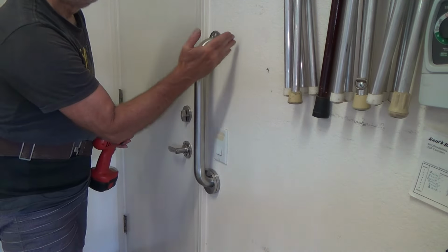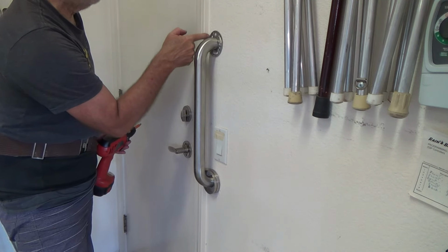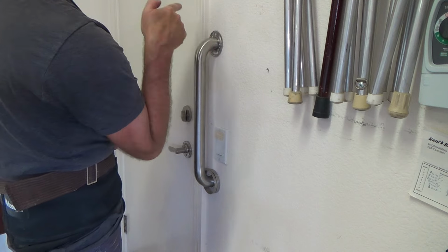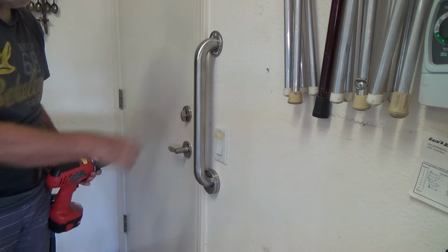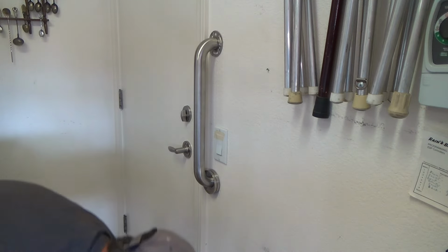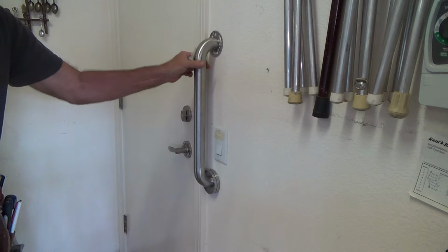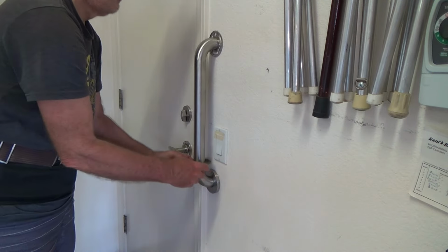Had I had this moved over, I could have moved this over a 1/2 inch and still caught the edge of the stud, not with the 2-inch, but with the 3-inch screw going through there and then hitting the edge of the stud on the side. You know what I mean? But you could hang off of that, and it's never ever going to get loose. And now I still have my stainless steel screws I can save for another project. I don't need those stainless steel screws for that because this trim is going to cover it.